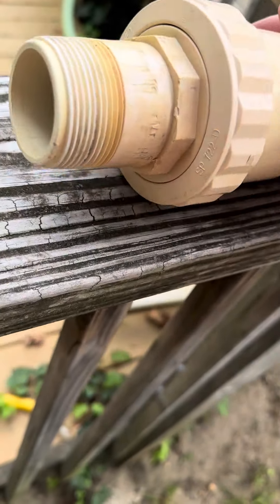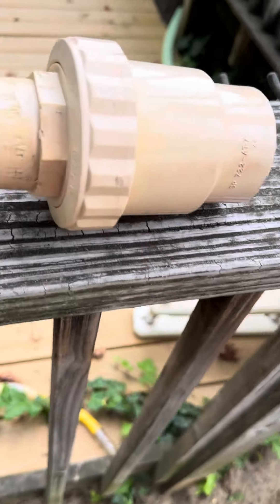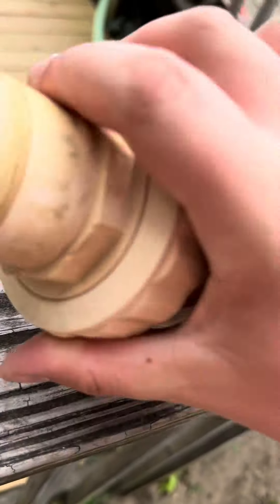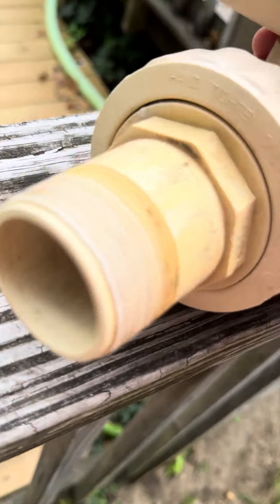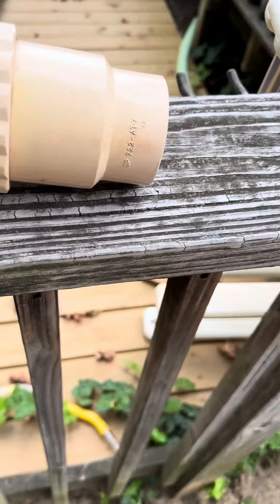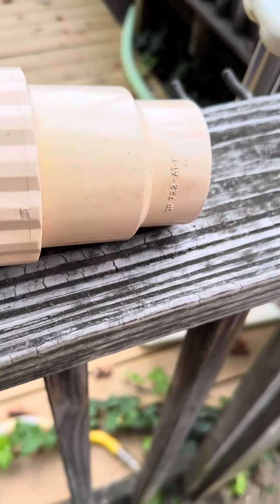The valves that you mainly see on the hoses are way different. Another thing about this ball valve — there's actually a ball inside of it right there. I'll close it so you can see it a little better. There's a little ball, and these have two seals on the side. That's going to help the valve not leak water.